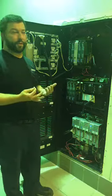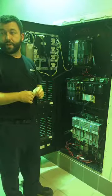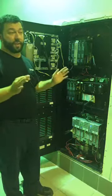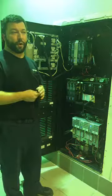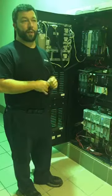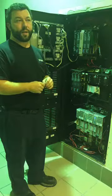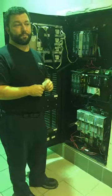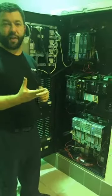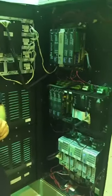All of our testing is going to be done on Tuesday — we'll have an empty building for Election Day. Testing will pretty much be our record of completion. We have to make sure all the speakers and strobes work, the elevators recall on an alarm, and there are some voice messages that go along with this system that we'll be testing at that time, as well as all the devices connected to the sprinkler system. It's a complete test to make sure 100% that everything is working the way it should.